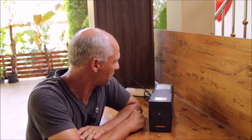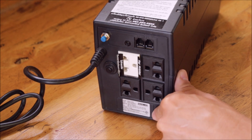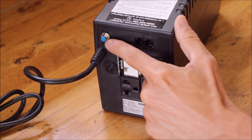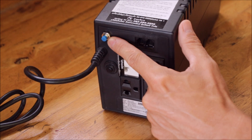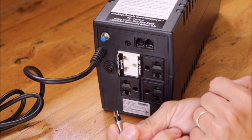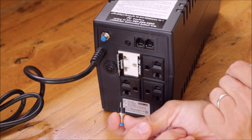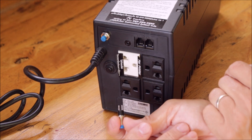But how can we fix this? Let me show you what I did, what I added, and then we will open the box and I will show you inside where this went. What was necessary to add is a small momentary switch like this. This was the best place to put this switch on the back panel of the UPS. Those two contacts are bridging our MOSFETs on the BMS. Battery voltage can then reach again our control board and more or less restart the UPS.